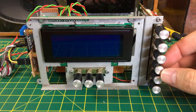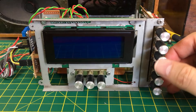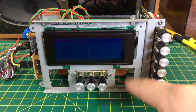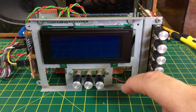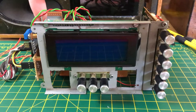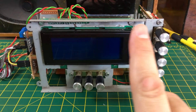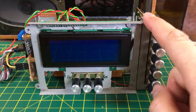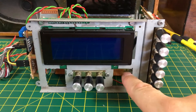A few of you have asked me to show what the inside of the radio looks like. It's been through a few incarnations but I think this is going to be the final mock-up before I finish the radio. A couple of noticeable things: obviously these holes here — previously this is where the potentiometer for the volume sat, and here was actually just a shaft with string that ran across to the back where the actual potentiometer sat. This was for frequency tuning, and the frequency indicator would move along here to show which frequency you were selecting. I got rid of that because I wasn't going to show a frequency indicator.